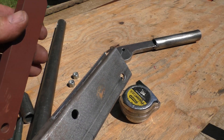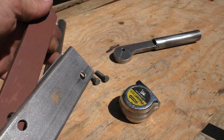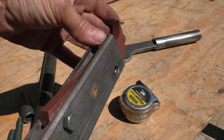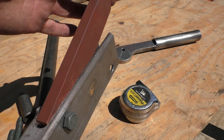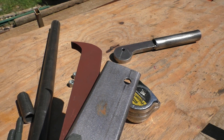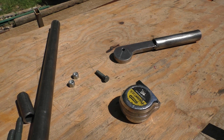The dog goes into the tube on the long side notch. The notch and the rounded-off end on this dog have a function — it was intended to only allow it to fall out so far. Otherwise, without being trapped somehow, it's just going to continue to fall out in that direction and be a pain to operate.